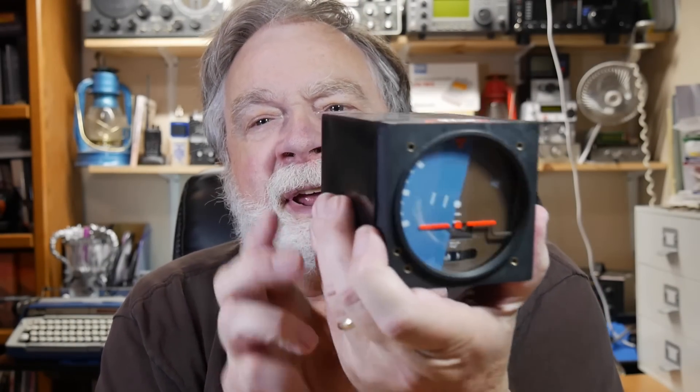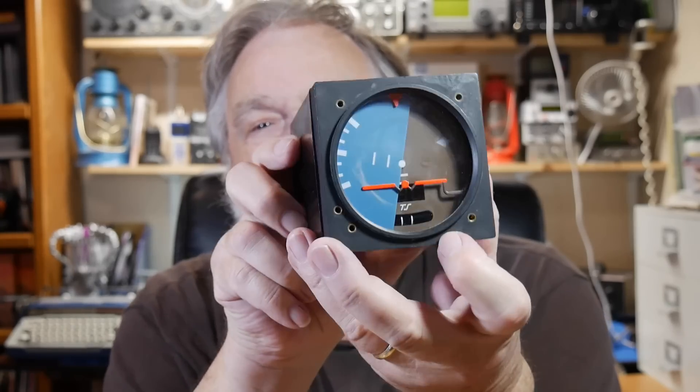But back to this thing. Since I took it out, the problem is — if I hold it up like this — we're looking at the world at a 90 degree angle. It should look more like that, but it looks like this, and it stays like that when powered and in the aircraft. You can tell it's trying to work because if you tilt the aircraft, the horizon stays at about 45 degrees despite what the aircraft does. And the direction shown here is the track.